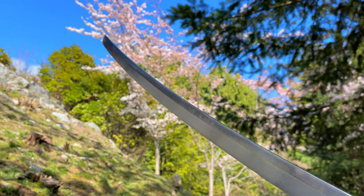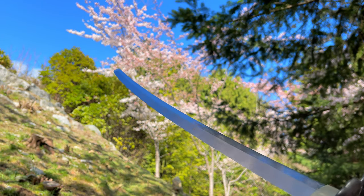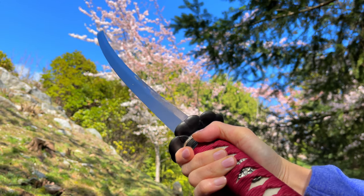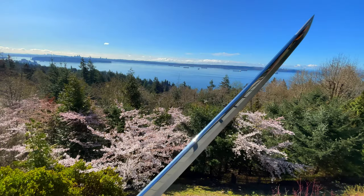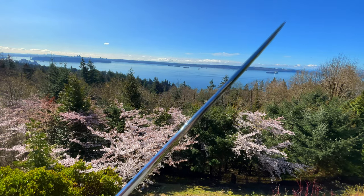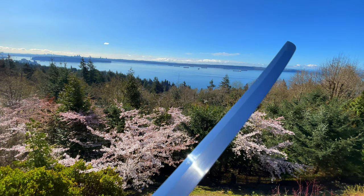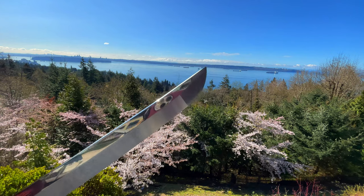The Spring Sakura's blade does not have any hamon or hada, which is fine. I like how straightforward and unpretentious it is, and modern steels, when heat treated correctly, are more durable in any event. The edge bevel is one flat grind from the shinogiji to the ha without any niku, so this is conducive to better performance at test cutting and keeps the weight of the blade down.